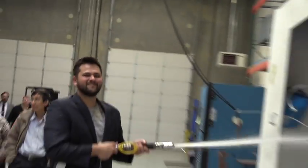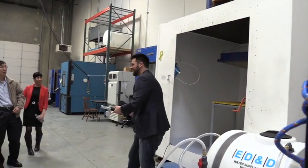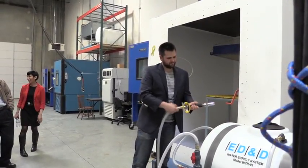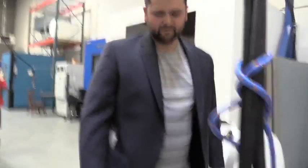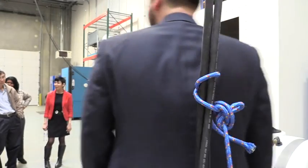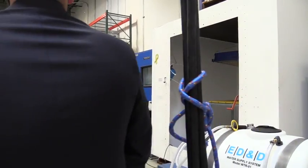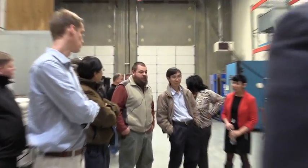This test tends to be more severe than most people expect. The EUT will sit on top of it, and quite often, just because of the pressure, we actually have to fix the EUT down. We can empty that tank in roughly five minutes — it is a very high flow. IPX5 is the same setup but uses less water flow. Numerically, IPX7 is considered more severe, but when you look at being hit with that jet of water for a minimum of three minutes versus dunking a unit for 30 minutes, it really depends on what you're testing.